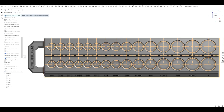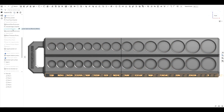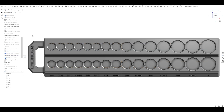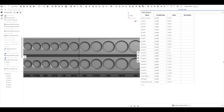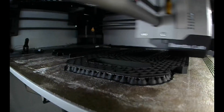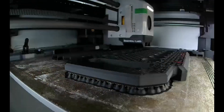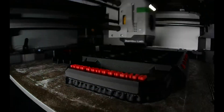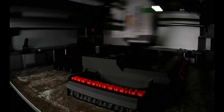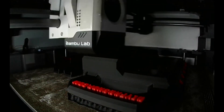Let's look at some of the modeling strategy I used to maximize the flexibility of the CAD. There's a master layout sketch which controls all the pocket sizes and the overall footprint. The pocket text labels are easily changed. Once the number and size of pockets are laid out, the location of the dovetail can be modified, and pocket dimensions have variables assigned so changes can be made quickly. From Onshape we export the STL files needed for 3D printing. I used PLA filament — it's easy to print, surprisingly rigid and strong. My racks generally won't see extreme conditions or UV rays, but if yours will, you may want to consider a different material.